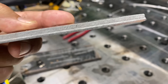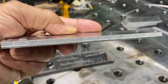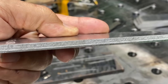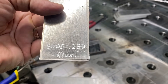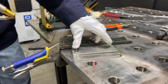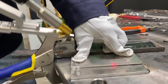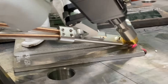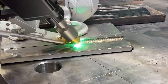In the previous video I showed welding a quarter-inch thick piece of 5005 aluminum. This piece had a rough sheared edge on it — we didn't do any cleaning prior to welding, no acetone wipe-down, no filing, no grinding, nothing — just slapped it down against another piece and made a quick fillet weld on a lap joint. The reason I'm mentioning that is if you're TIG welding or taking a TIG welding test, you want to clean that rough sheared edge — it'll cause porosity every time, whether you're doing a fillet weld or butt weld. In my experience, that is probably one of the number-one culprits in failing a TIG welding test.